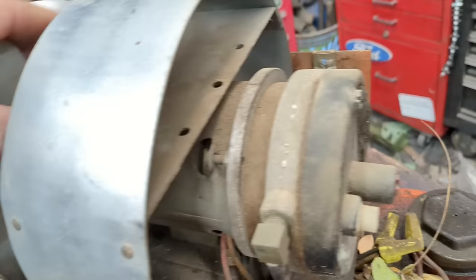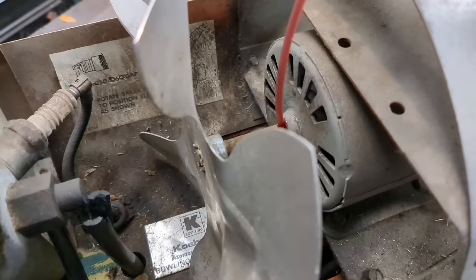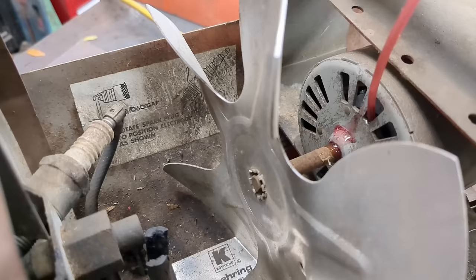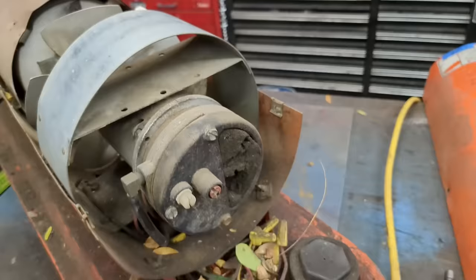We've got crap in the back of our impellers — there's a little impeller pump back here. We'll take that apart and look. First I'm going to take some automatic transmission fluid — just a really thin oil — and start soaking this bushing, getting some right on the inside to drip down on that bushing. That actually made a little bit of a difference already.